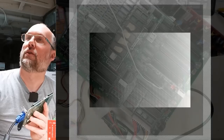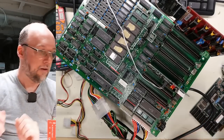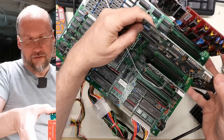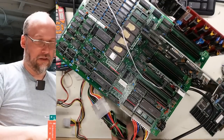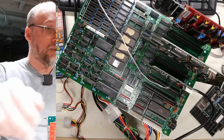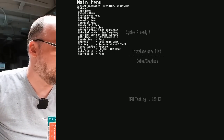Let's pop the VGA card out and see what happens. It just beeps right away, same thing. I'm going to stick a CGA card in here. Power this on — we're not getting a beep now. Let me get out the RGB HDMI converter so we can see what's happening. We have the RGB HDMI hooked up. Let's turn this on — whoa, I saw something. Is this working? I just realized I have to set the switches to CGA, which I just did. Look at that — it gets rid of the menu. RAM testing 129.